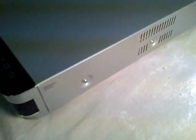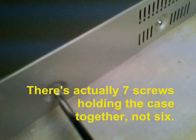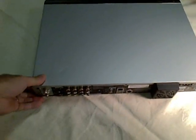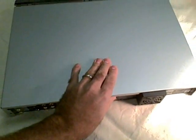The first step is to identify the six screws that hold together the chassis cover. There are two on each side and two on the back, for a total of six. Now that all the screws are removed, grab the two sides of the case and pull toward the back so that the little lip is exposed. Then just lift the case up.